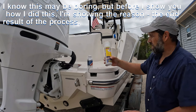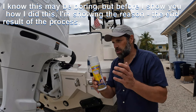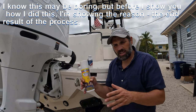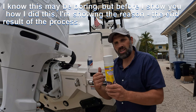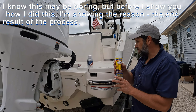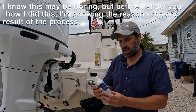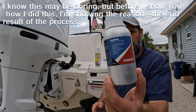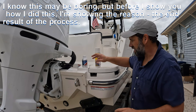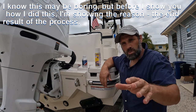Below the waterline has two coats of the Aurora, which has very specific instructions. I actually hauled the boat out at a boat yard and put it on boat stands — it's a little tricky on a trailer — so we could rotate the stands and get good coverage on my brand new boat. Then on the top sides, everything from the water line up, I've got the Glide Coat marine ceramic, with very specific steps on that, and I've got a video of finishing the application.